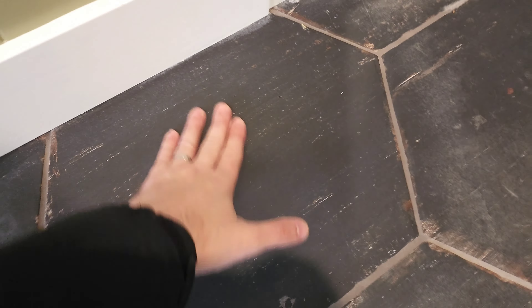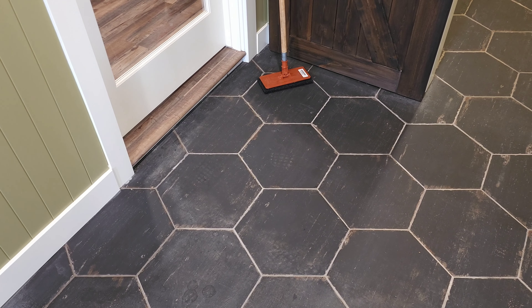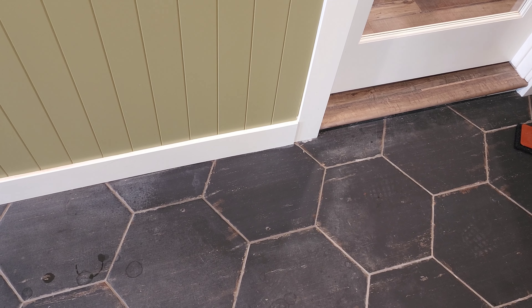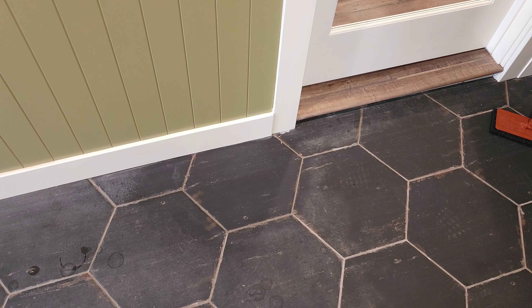I tested a spot here and this is pretty much completely dried out, so we're good to go. What I had to do is use an acid cleaner, and then I used my stripping scrub pad to do this edge here so I didn't worry about hitting the baseboards. I'm going to be stripping the floor with my buffer — black pad and a guard on it to protect from the cleaner spitting all over the place — and then neutralize it and rinse it off afterwards. I've tried other stuff and it didn't work, but the acid is what's doing the deal here.